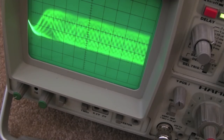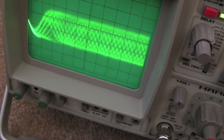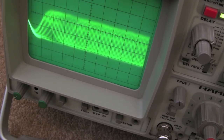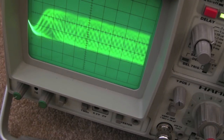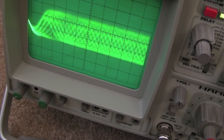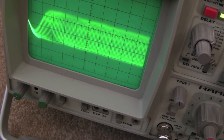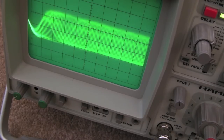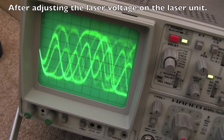Testing with a CDR now — we've got almost three divisions, so just under 600 millivolts. I might try increasing the laser pot a little bit to bring the RF level up. It's quite strange because this laser's pot position is wildly different to what the original was — the original was kind of centered, which is about right for most optical pickup units, somewhere near the middle. But this one is getting close to three-quarters wound around, which could be accounted for by a different pot size.